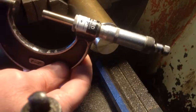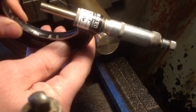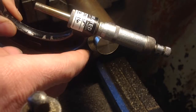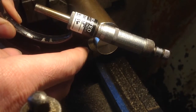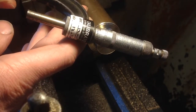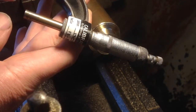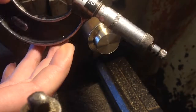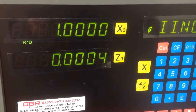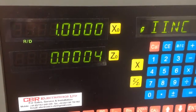No cheating here — that's the light. Look at that. Let's get it focused. That is 1 inch 4 thousandths, between 7 and 8 tenths. Let's go for my 1 inch and see what happens. There's 1 inch dialed in. We'll take a cut, we'll measure.